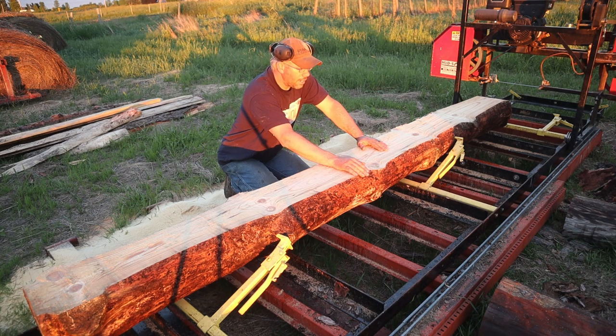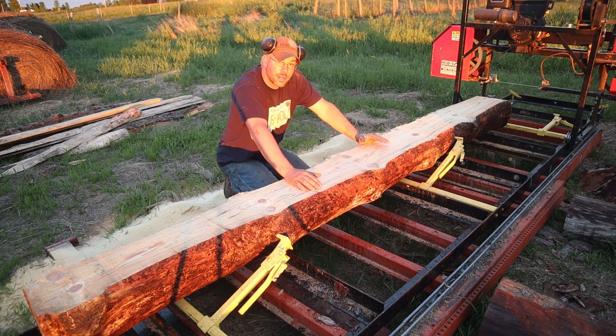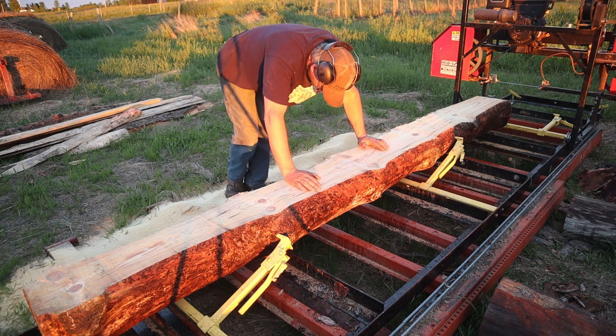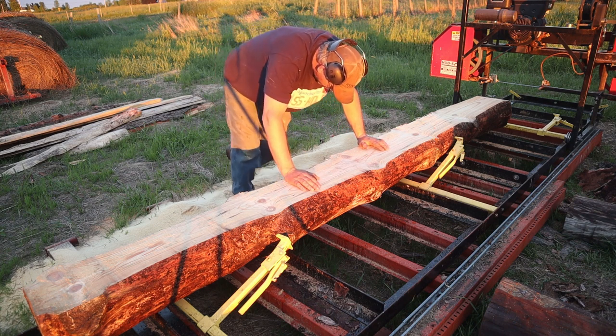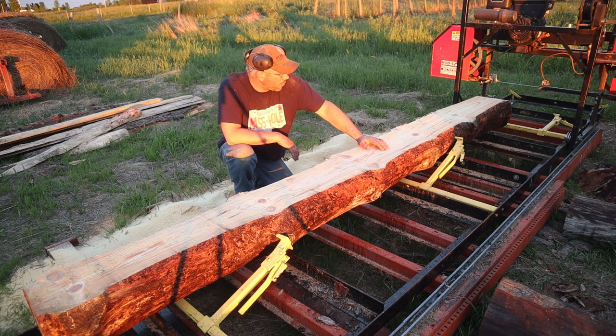And you can tell when you're going to cut it down. If you're cutting a tree down and it has a bunch of branches sticking out of the side of it, chances are it's not going to be worth a damn for braces. And you want the stuff as straight as you can, as straight grain as you can, and as clear as you can. And if you're cutting a softwood frame, a lot of times hardwood braces are nice. I still use the white pine just because it's such a stable wood. It's usually pretty straight grain.